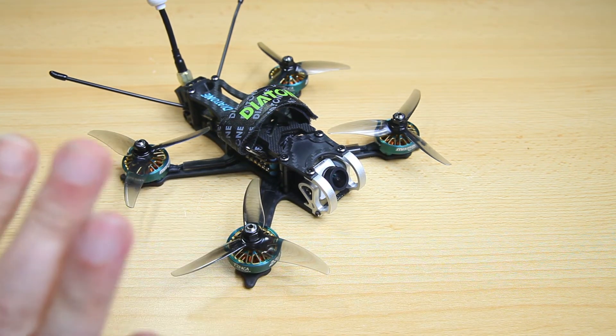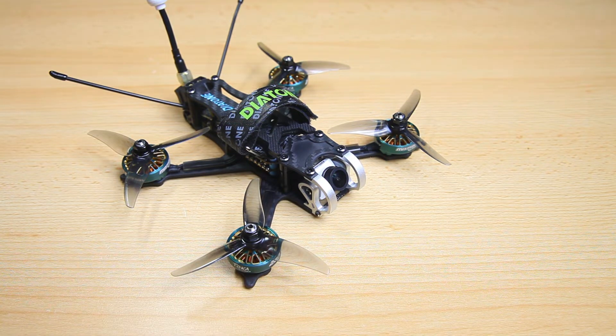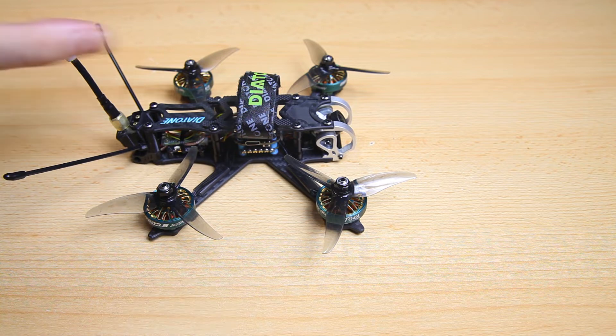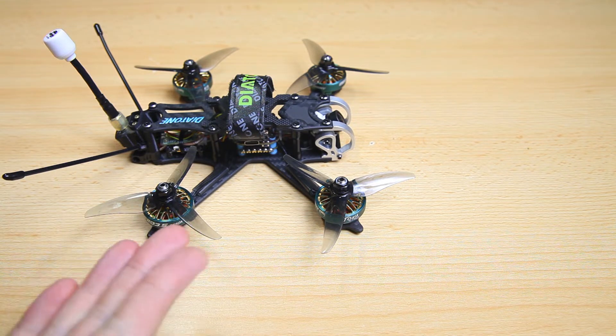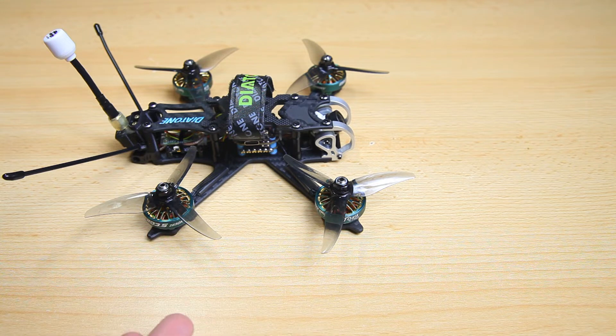So that makes it a little bit of a weird setup, but it's definitely fun — maybe it's fun because it's different. The other 3.5 inch quadcopters you'll see will mostly be light, long range cruising quadcopters. This is definitely not a cruiser; this is a torquey freestyle quadcopter. At first I thought it wasn't fast until I pitched up the camera more, and sure enough it became quite a fast quadcopter. But they were essentially forced to use these motors on something else. In my mind they could have used them on a 4 inch quadcopter as well — these motors could definitely handle 4 inch propellers.